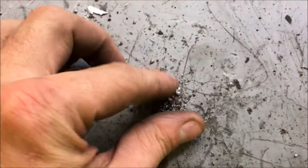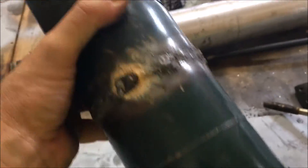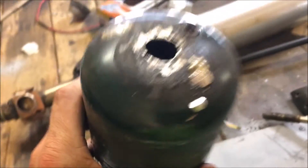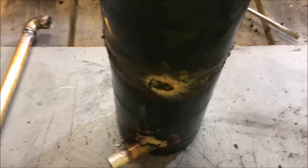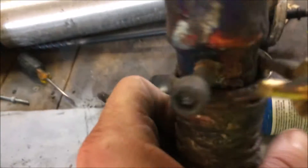So the cyclone was empty. Most of this stuff is probably from manufacturing — that's mostly solder beads, so it was completely empty. This wasn't necessarily a dust cyclone as much as it was meant to cool down the gases so it didn't burn up my blower pump. So that's how much fuel was still left in the tank — we didn't burn very much at all on that run. Total failure, but I did learn the importance of sealing upstream leaks.